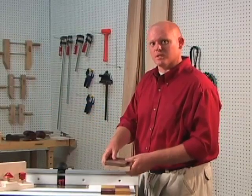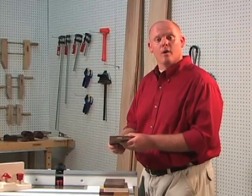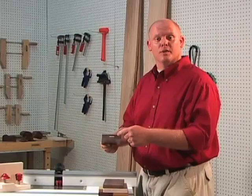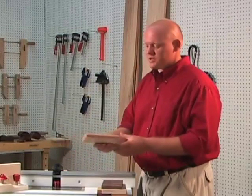And this is going to reduce our sanding time. And unlike biscuits or dowels, which can be seen with improper placement, this bit allows us to have a seamless joint regardless of where we route or trim our stock.